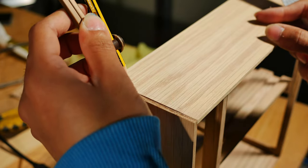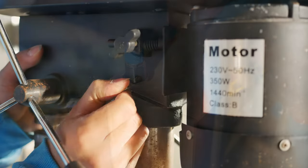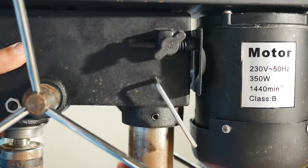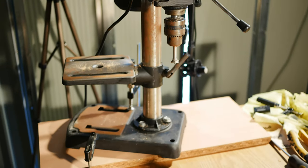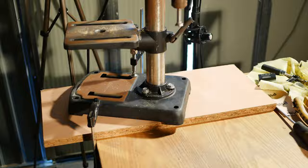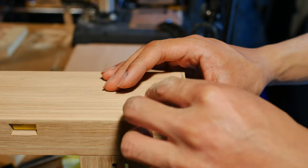Let's mark the position of this power switch, up top and bumped as close as possible to the front. Now, going about the fact that this pillar drill isn't tall enough for this box requires simply loosening it from the column and rotating it, making sure that the base is clamped down. Jammy, I know. At least we've whipped out one of our all-time friends, the Forstner drill bit. 16 mm this one.